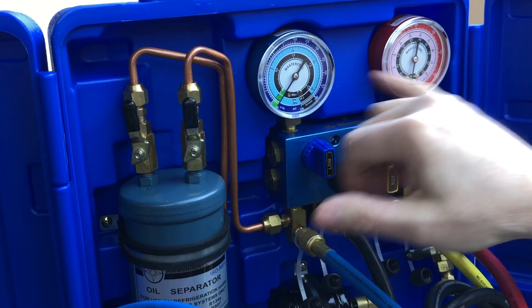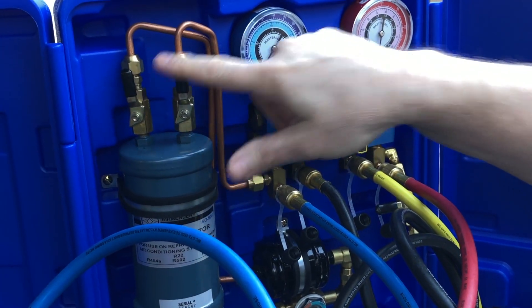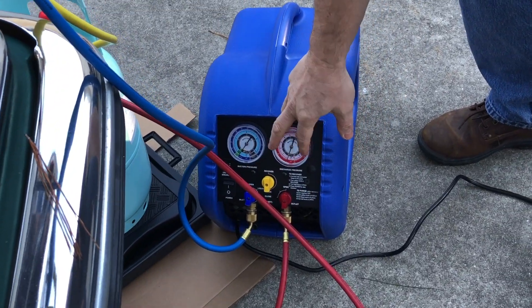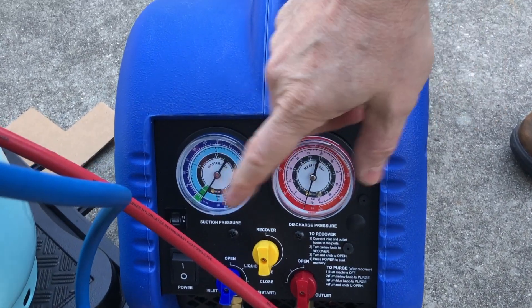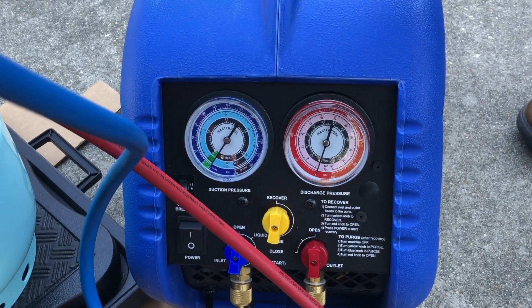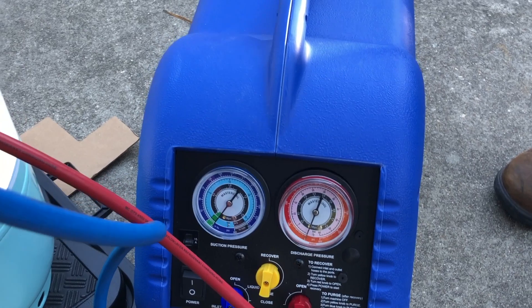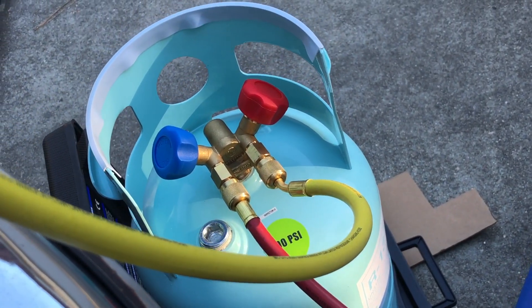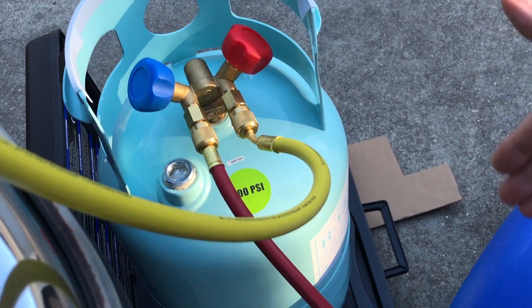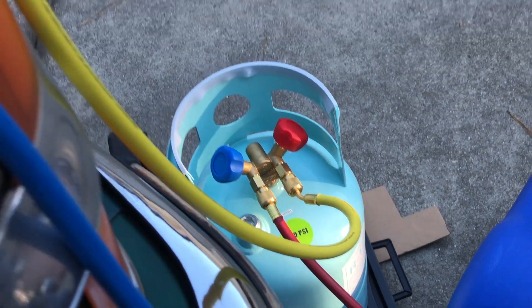At this point we're still reading a vacuum on the 69500. We've got our vacuum line just sitting here turned off. These two valves are open, our oil drain is closed, our auxiliary port is closed. Down here on the 69000 we've left our inlet and outlet valves open. When we did the vacuuming we had it on purge — we're still holding a vacuum. For this next step we're going to turn it to recover. Both valves on our cylinder are turned off and we'll leave those off for a moment until we open up the unit. We've got our scale under there ready to go.